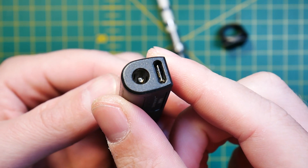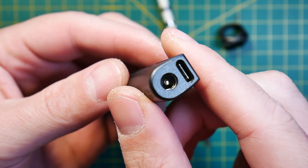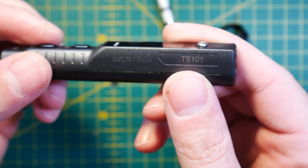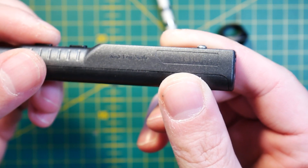The biggest change is the way you power your soldering iron. If you're using the DC jack, you have access to 65W of power and the supplied voltage ranges from 9 to 24V. But on top of the barrel jack, you'll also find a USB Type-C connector, which uses USB Type-C PD to deliver up to 45W of power. It's a little bit less than the direct DC connection, but plenty enough for most of the soldering tasks you want to do.